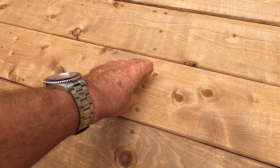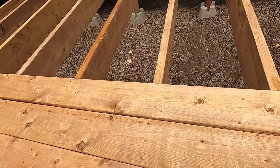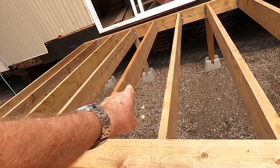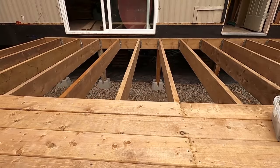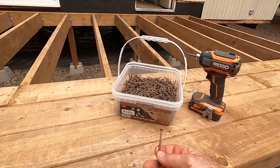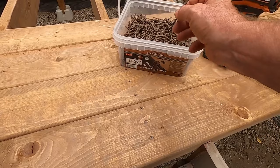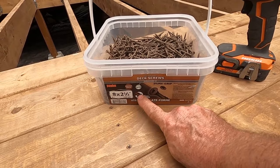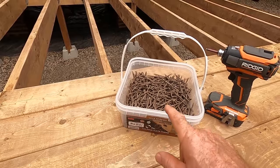With a six-inch board we use three screws. The rule of thumb is: four-inch board gets two screws, six-inch board gets three screws, eight-inch board gets four screws. Our joists are eight-inch material so each has four screws in them. Two-by-ten gets five, two-by-twelve gets six. Again, because it's treated wood we're using ceramic-coated ACQ screws — two-and-a-half inch to screw the decking down. These come in green and brown; since I'm using brown wood I'm using the brown screws.